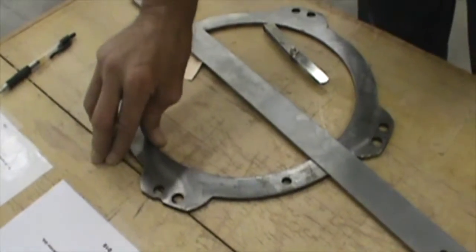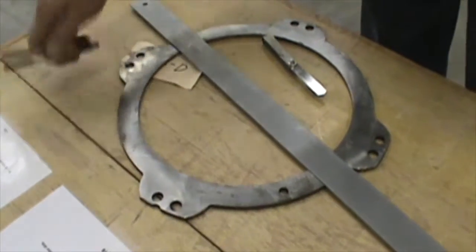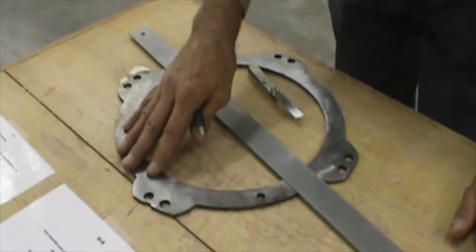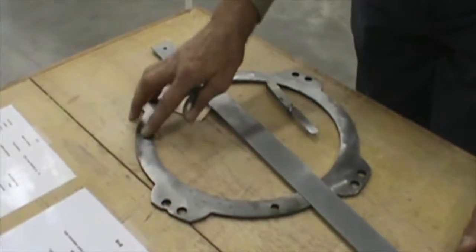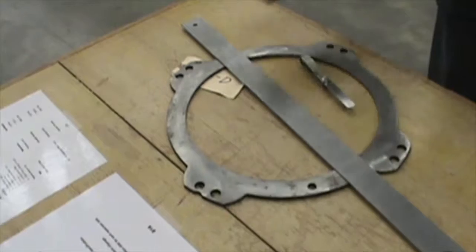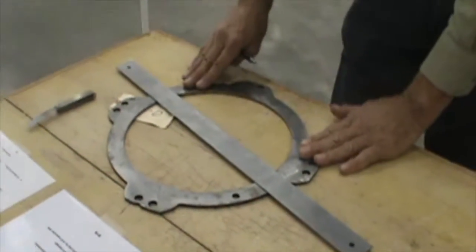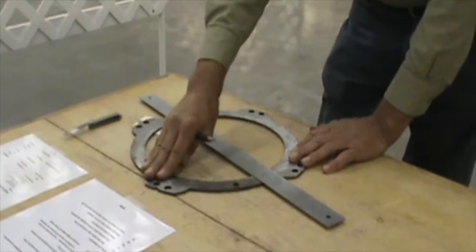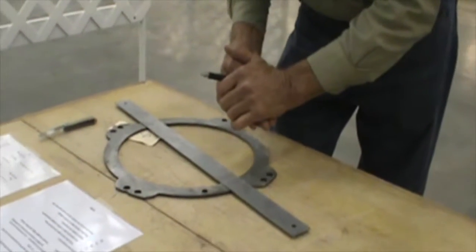Here's another question: this plate shows signs of severe slippage. If you were to have severe slippage, you would have bluing and dark discoloration on the face of the plate. Slippage would generate heat, and the heat would cause warpage. So no, we do not have any signs of severe slippage. Next question: there are always two friction discs for each separator plate. That is incorrect. You need to have a separator plate, then a friction disc, then another separator plate. If you were to have two friction discs together, that would be fiber upon fiber and a catastrophic failure.